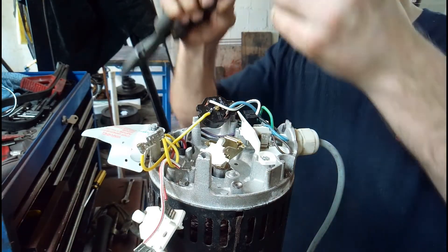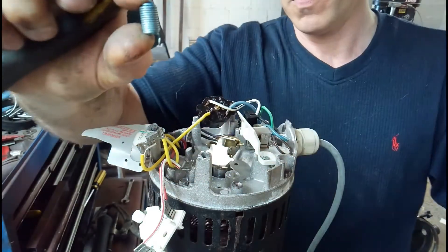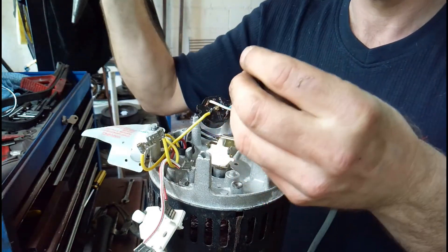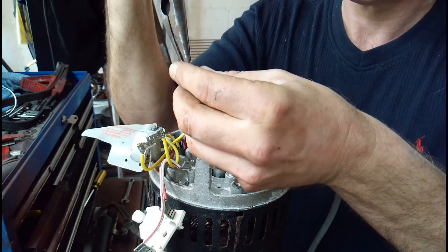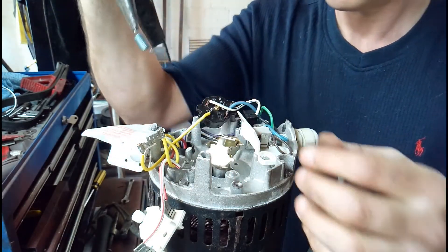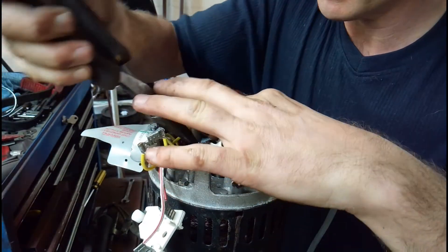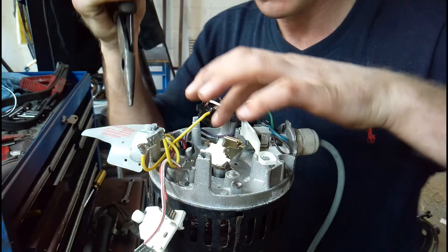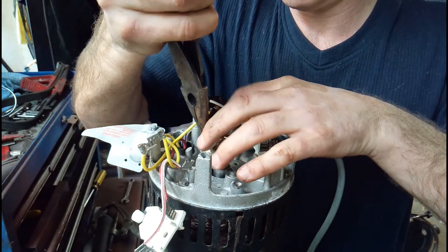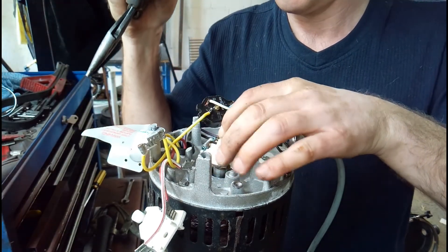The springs — now these are the springs. You'll notice that the loop on one side and the hook on the other side are off centre. The flat part goes parallel to the switch itself. If it goes the other way then the spring itself will be hitting the plate, and I'm pretty sure you'll see what I mean if I have a little bit of a close-up in a second. So holding the spring with long nose pliers just on the very edge so there's still enough room to get the spring over that tab.